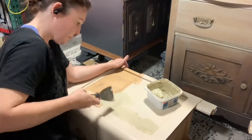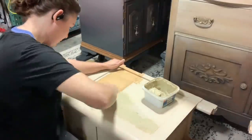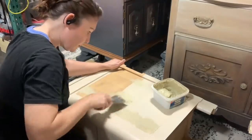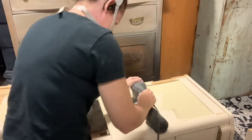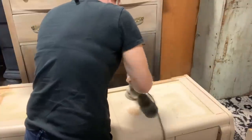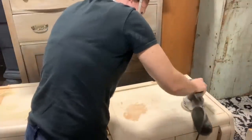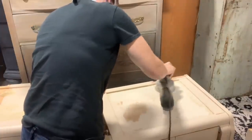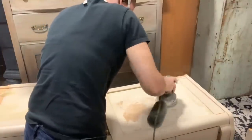Know that it is going to have a different consistency than the wood around it, so you have to prime when you do stuff like this because this is a huge fill job and you have to make sure that when you go to paint all your surfaces are of equal consistency. I let that dry overnight and then went back in and sanded it smooth. For really thick layers I would do a layer, let it fully dry, then do another layer — but this was mostly just a skim coat to smooth everything out since there was so much veneer I had taken off.